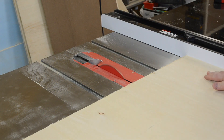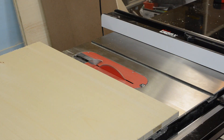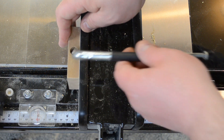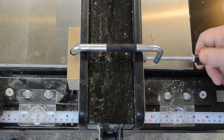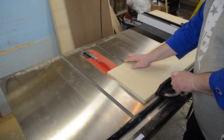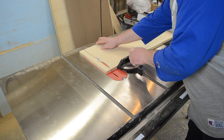I started by cutting my plywood to size — two sides and a top and bottom. The sides measured approximately 12 inches wide by 30 inches tall, and the top and bottom approximately 12 inches by 12 inches. I could then attach a small stop block on my table saw fence so the wood won't bind between the blade and the fence. I like to cut my pieces a little bit oversized before I start to actually whittle them down and make them square.